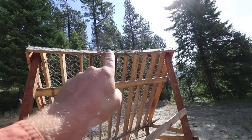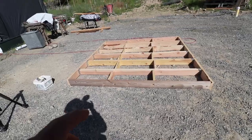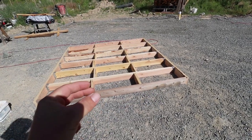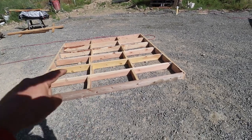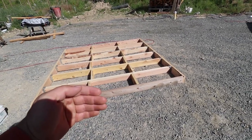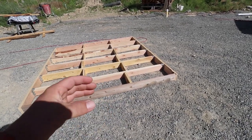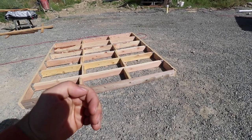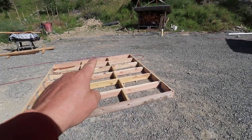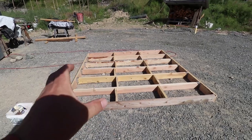I might try though, putting a box on the outside of this brace and this brace here. So on our new Grizzly, if I box the ends, that box is going to have a tremendous amount of rigidity this way, which is how that board wants to bend. It wants to bow like this under all that pressure. By boxing it, you get the strength of this vertical board, which provides a lot of strength for the weight of the rocks. And then by putting a box on the end, you're going to have a lot of resistance for the motion of the rocks this way that are likely to try to pop those nails off. It's going to take a little extra wood, but I've got some wood on the sawmill that I really need to get milled up. The sun is starting to have an effect on it. And then I've been pondering this, which way to orient this, and I want to try this.